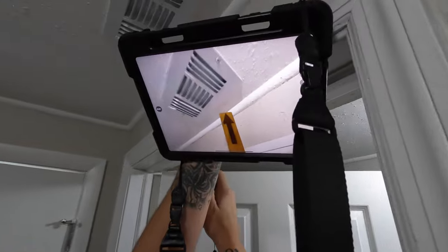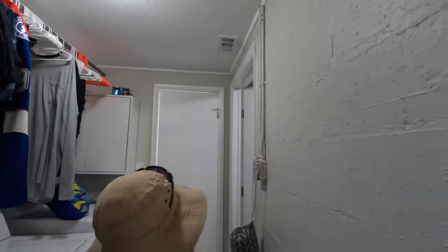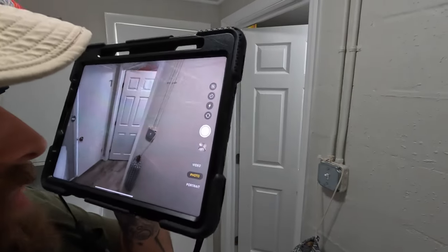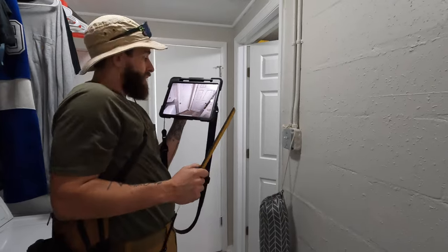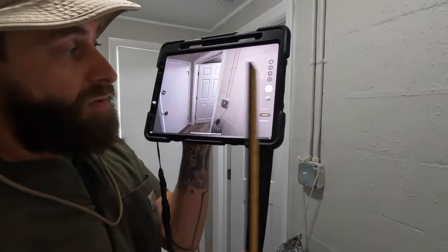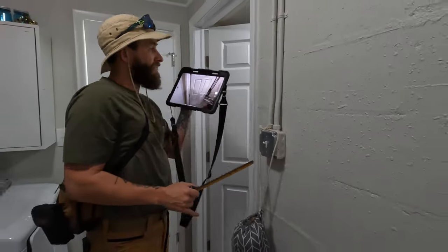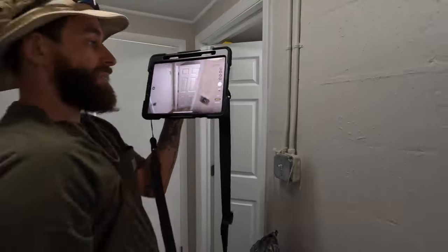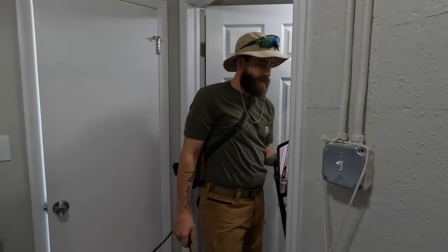For ceiling shots, get a good close-up where I can see the texture, then get down on one knee for a good perspective shot. Heading into the next room — take a step back, snap that picture, and label it. The first photo I label for each room is taken from outside the room. I would name it 'storage closet' and then go into it. A lot of people take the label photo inside the room — I disagree. Taking it outside gives everyone a good understanding of what you're going into and where you just came from.